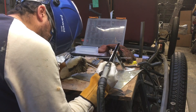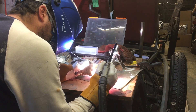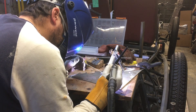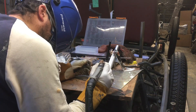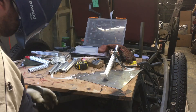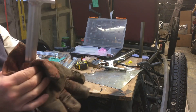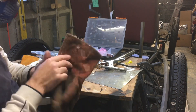It is quite key to get the temperatures right because you mustn't overheat it, otherwise you'll expand what's called the heat-affected zone — the area around the weld which is basically weakened. The aluminium I'm using is 6082 T6, so it's got a T6 temper hardening on it, and when you weld it, it basically loses that hardening. It does regain it a little bit in time, but generally with aluminium, welding always weakens it slightly — which becomes a problem for me a bit later on in this video.